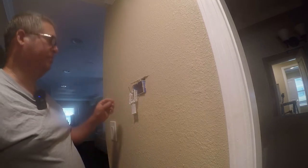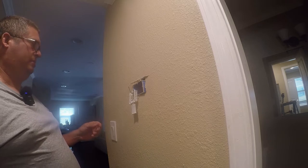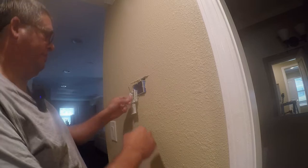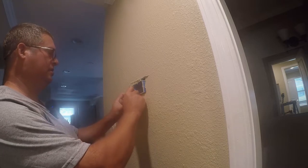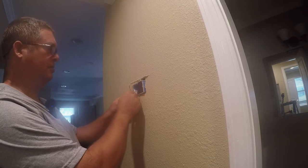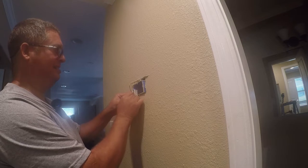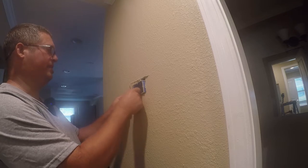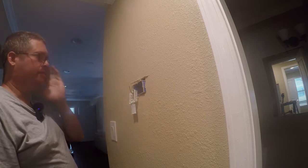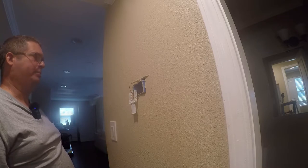All right, and then I'm gonna sit here and think about it for a second. Let's see where common actually is at. C, C, C, C, C. Oh, it's over here, all right. There we go, so that's common. And then we've gotta connect E. So I'm gonna look, yellow, ground, common. Yeah, so we got everything we need at this point except emergency heat.